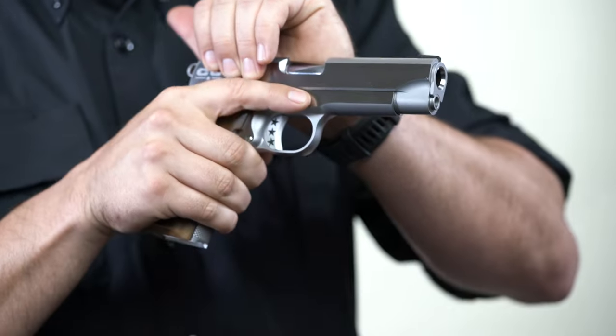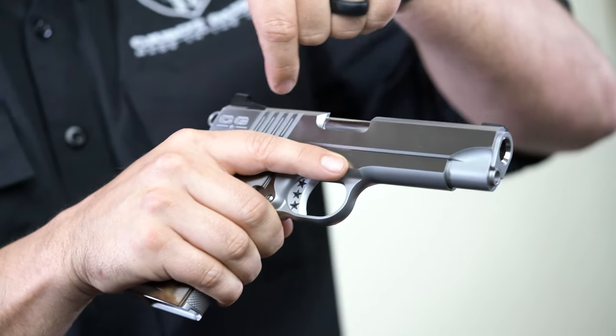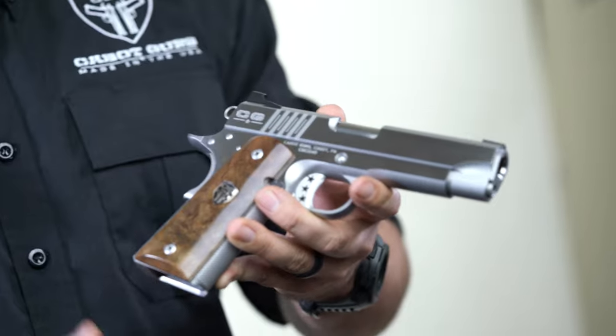So you're going to have some texture back here to be able to grip when you're racking the slide. We even go so far as to feather inside — one of our tool tips goes in there and feathers that cocking serration, which just adds a nice touch and breaks up the look of the cocking serrations.